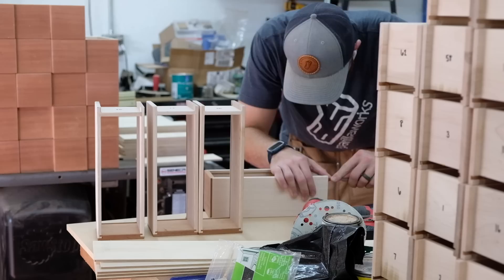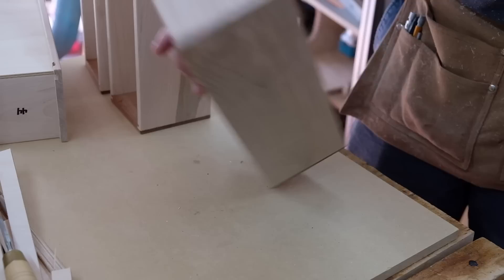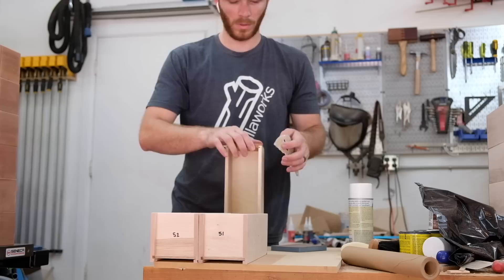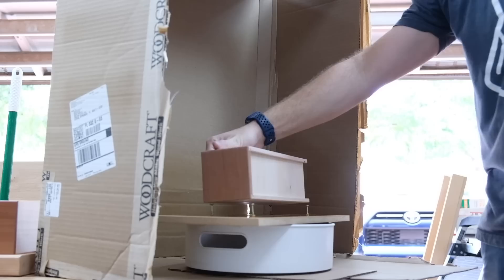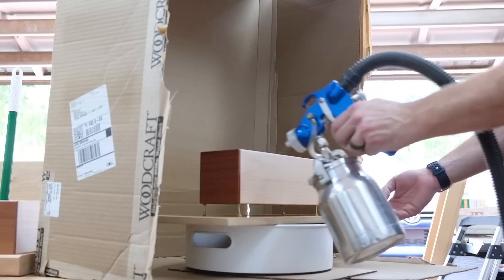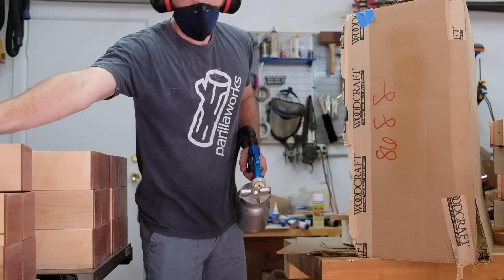Next I add the drawer bottoms — they simply slide into the grooves I cut way back and are secured with a 23-gauge pin nail. This battery-powered pin nailer is one of my favorite new tools; it's so much more convenient than having a compressor running in the background with a hose tangling you up. After some final hand sanding it was time to spray some finish. For the drawers I used Minwax Oil Modified Polyurethane, a water-based poly that will amber the wood like an oil finish — the same finish I used on my large walnut apothecary cabinet earlier this year. I set up a little spray booth with a lazy susan which helped me keep control of the drawers and move quickly, and after a light sanding after the first coat they were left with a beautiful feel.